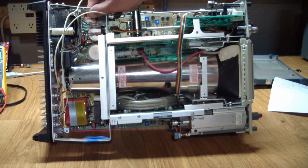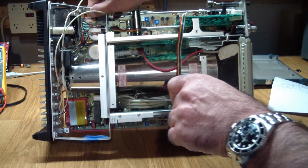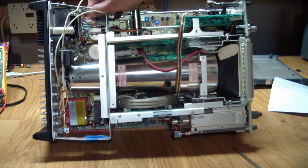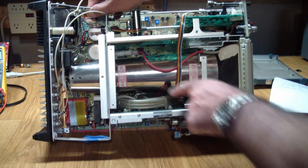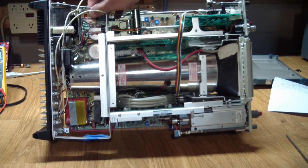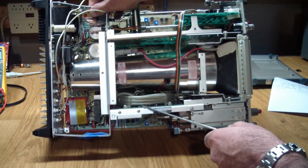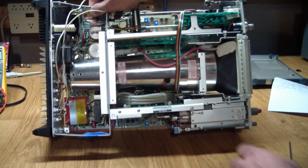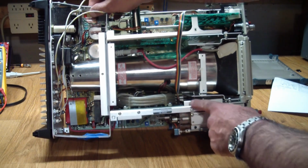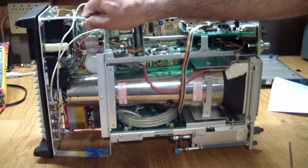There are some other gotchas with this. These white wires are very short, and they connect to this board underneath this bunch of wires over here. And it's a pretty delicate act getting these wires plugged back into the board. Let me just warn you, I don't have a tried and true method. You just have to sweat it out. What I actually ended up doing was loosening these screws so this whole assembly would slide up, and sticking a pair of pliers underneath and just finagling the two wires to go back in. But be careful when you're removing this board, and be very vigilant when reconnecting these wires to where they belong.